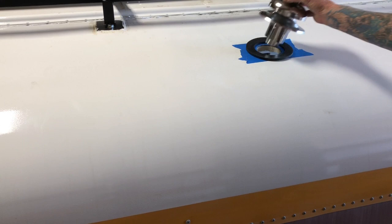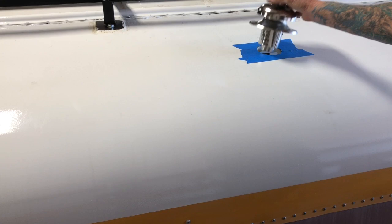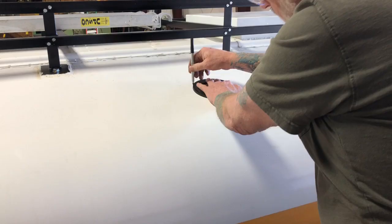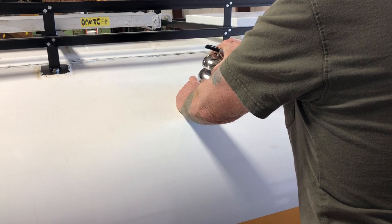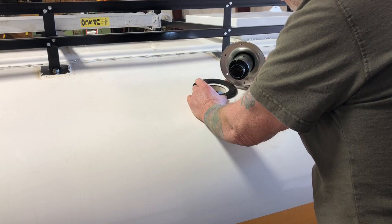I got a hole in there. I can see it fits easily enough, and the three-inch hole they recommended cutting has clearance for the pipe, and for the other pipe to slide up over it. I'm going to use this ceiling grommet as a template for where I'm going to drill my holes. I know that's where it goes, centered in the hole — got that marked out. I drilled these holes out because it's made for going in the wood deck of a boat.